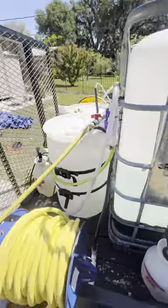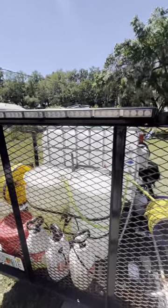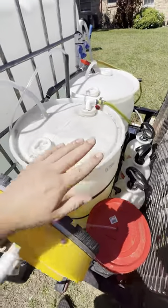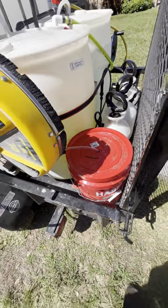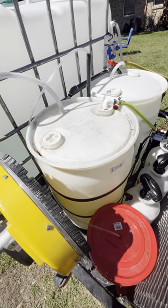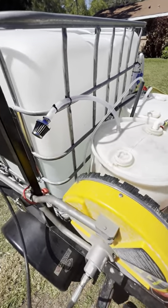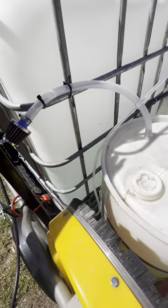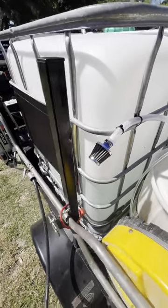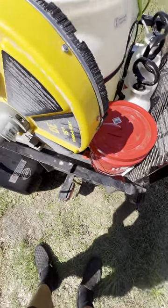This little box has a voltmeter so I can see what my soft wash battery level is. I also have a control switch for my traffic advisor light bar when I'm on commercial jobs or have to park in the street — that's really nice to have, makes me feel safe. I have a sodium hypochlorite tank here and a surfactant tank — literally just a 5-gallon Harbor Freight bucket. I've never run out of soap; I usually don't even use soap on some jobs, only when I really need it to stick to a surface like a fence or house. I have a little breather on the SH tank — I read on a forum that if you gas your sodium hypochlorite tank when it sits, your fittings won't corrode as bad, and I've actually found that to be pretty true. I don't find myself needing to douse it with WD-40 as much as I used to. It's dirty but it's in great shape.